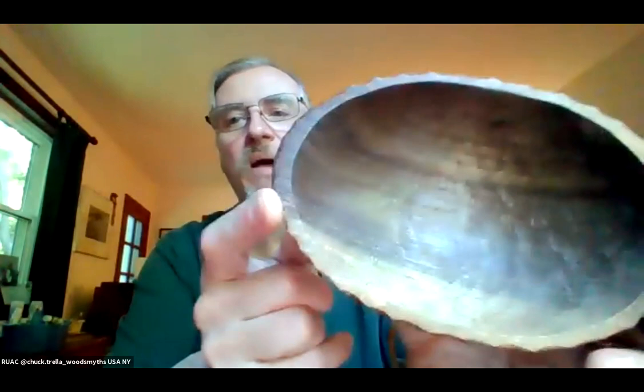I tried just about every tool that I have doing this. I started off with the drill and the drill bit. I used my large gouges to hog out a lot of the wood. I used my swan neck gouges, which were actually a little too wide for this size of form. Because it's hard and I was putting so much force behind it, it would suddenly go through and ding into the opposite side. So I ended up doing most of this and finishing it off just with handheld hook knives.